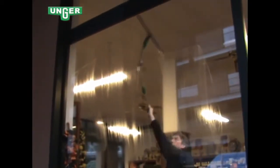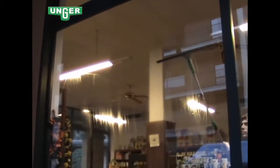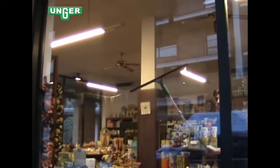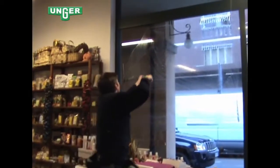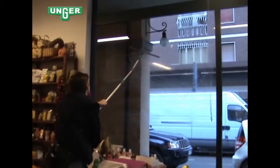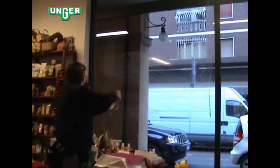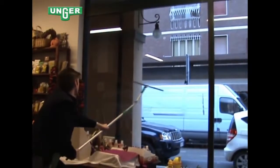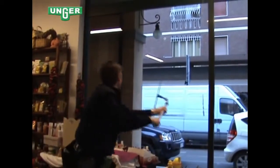We can see here that it is quicker to work the window from side to side or by fanning. By using the angle adapter inverted like this, it is possible to steer the squeegee using a screwdriver action off the wrist. This works well when cleaning windows over obstacles. Notice the use of the shoulders and body position to allow the turning of the blade.